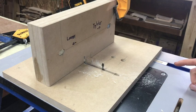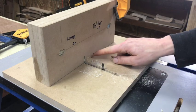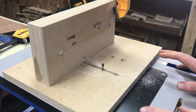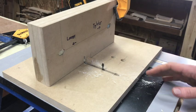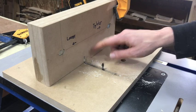One thing I will say just one more time is, if you need to make your box joints tighter, move the pin to the right, away from the bit. If you need to make them looser, scoot it in a little bit. And we're talking generally like a paper width here. Nothing significant usually, unless you're way off, but you should be pretty close with your key, which is why we save the off cut from this.